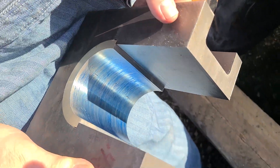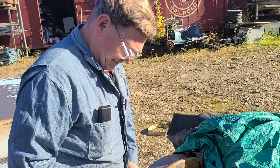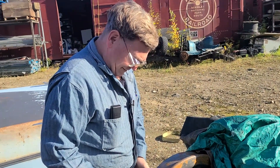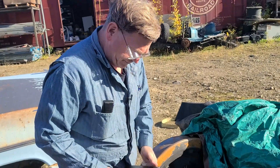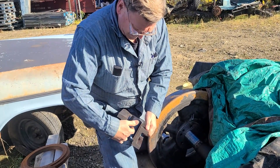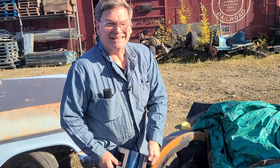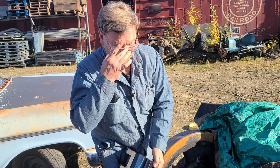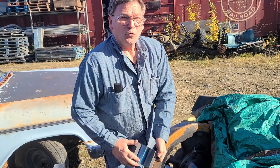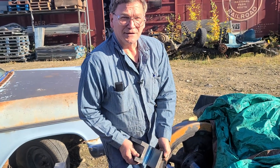Oil will be slightly thicker than that bluing — the bluing's a little thin. So that'll work. Now put a couple tapered pins in it and put in the oil holes — something I'd been forgetting about. And I've got a couple of lock holes that go here for a cellar that goes below this. It's a waste packing cellar, they call it, because it's down low. This actually rides on top, and that's for holding extra material to make sure there's extra oil to keep the shaft all nice and oily.